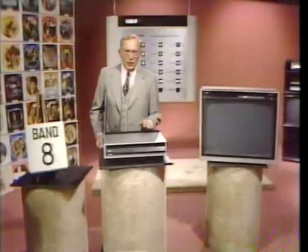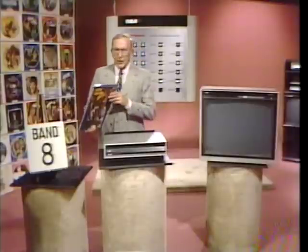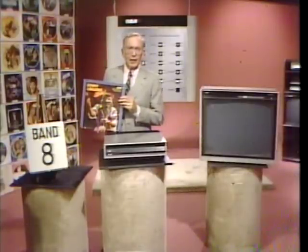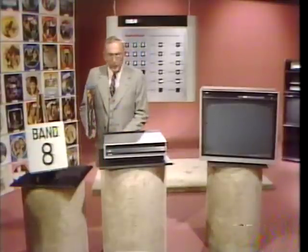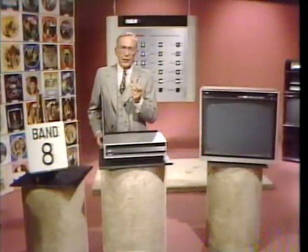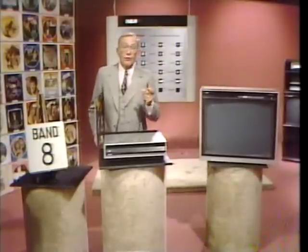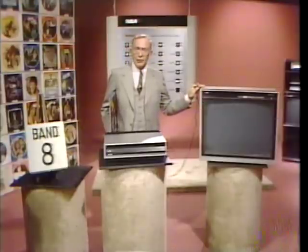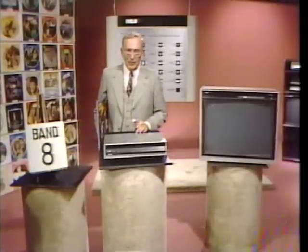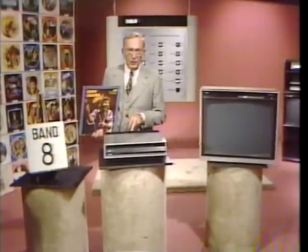One important SJT-400 standard feature is stereo playback capability. The number of stereo CED discs is growing rapidly. Concerts and now many movies are being added every month. Stereo outputs are located on the back of the player. They must be connected to an external stereo amplifier speaker system or to a stereo-capable television receiver or stereo monitor like this RCA SelectaVision unit. The player automatically selects monaural or stereo playback. All stereo discs are enhanced by the player's CX noise reduction system.